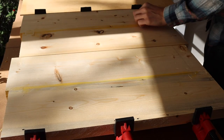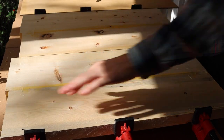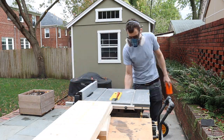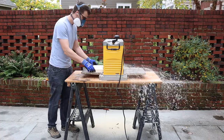With the boards dried I removed some excess glue with my chisel and I trimmed them down to about 12 and a half inches so that they would fit on my planer. I ran them through a few times to get them to about roughly one to one and a quarter inches thick.